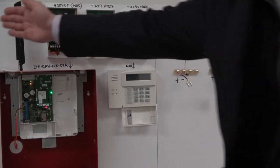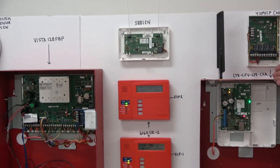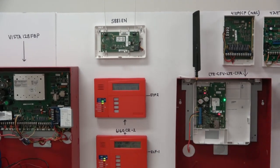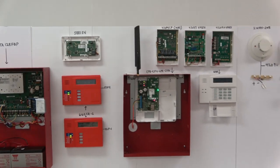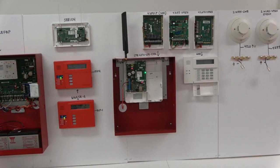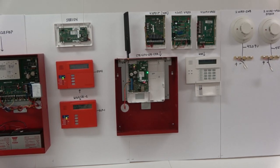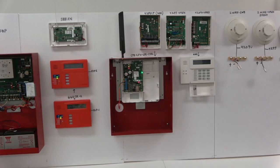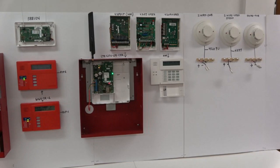We have the receiver in parallel with the ECP-1 bus. The same holds true with the wireless radio alarm transmitter. The keypad on ECP-1 is also in parallel, all connected together. All of these modules also connect in parallel in some form to the bus, primarily power. In addition to that, we have the burglary keypad which also is on the protected side of the ECP isolator.